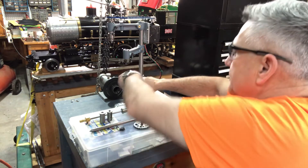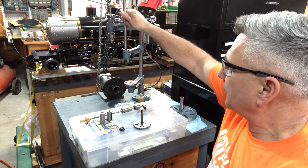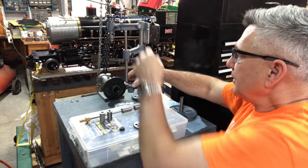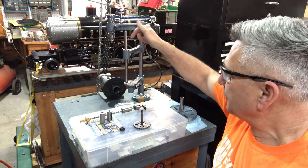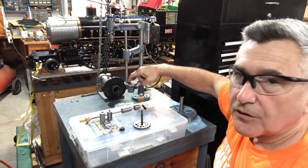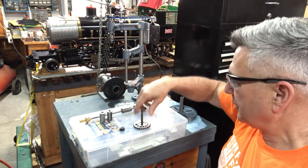We'll place that in here and leave it loose for now. With the half-inch sleeve in the upper part, I put the steel in there. When I made the sleeve I reamed it out to 0.501 inches — right at one thou bigger — so it's a nice sliding fit but completely shake-free. Using the conical point, I can locate very quickly the center of the hole in the bottom of the stake plate, then lock it down with the arm.